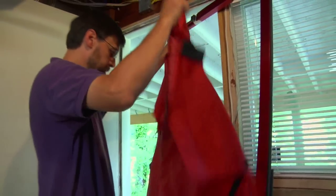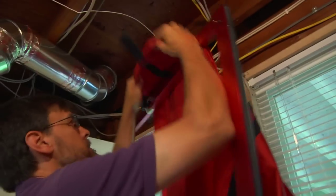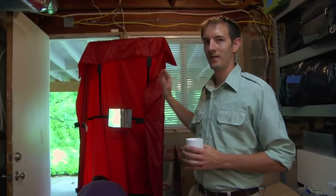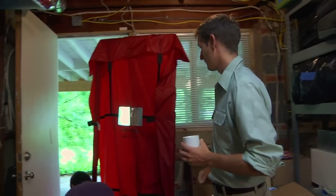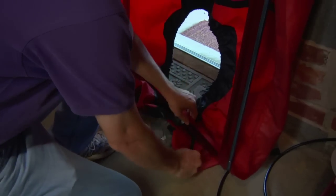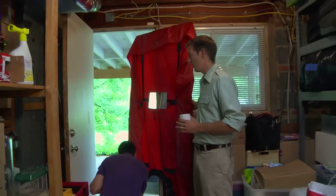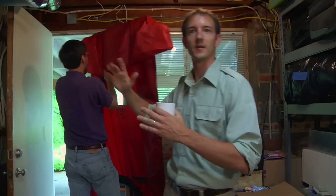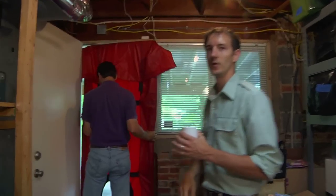There are really two techniques for doing this. You can lay the canvas on the ground if you have space and then put the frame on it — I find that a little bit easier, and that's the way I was trained. But Glenn, being a little bit taller than I am, is able to do this all standing up. The canvas provides a nice tight air seal around the door, so when you turn on the blower door there won't be significant air leaks. As he's putting the canvas up, he's velcroing all the different pieces. One tip is that you want to get the canvas on as tight as you possibly can — the looser it is, the more it's going to suck in as you blow air out. That creates a sail effect and a lot of force that can push the door in and have it fall in on you, which does happen a lot, especially for folks doing it for the first or second time.